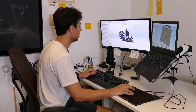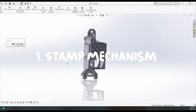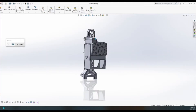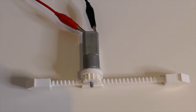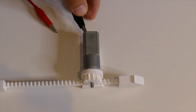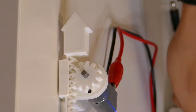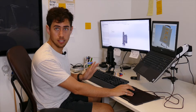There are three distinct parts of this CAD. The first part is the stamp mechanism, which uses just a single motor hidden nicely in here. It's just a regular DC motor. You give it power and it turns one way; you give it power in reverse and it turns the other way — very simple from a control standpoint. The stamp mechanism uses this rack right here and this pinion, and when you give power to the motor, it moves up and down on this track. That's the stamp mechanism.